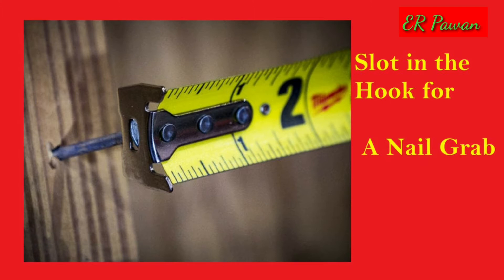Feature 2: Improving the tape measure's longevity. To avoid having to recalibrate all the time, don't allow your tape measure to retract at full speed and smack the hook against the case. Develop the habit of stopping the end against your thumb instead, which is a good incentive to slow down before you take your finger off.